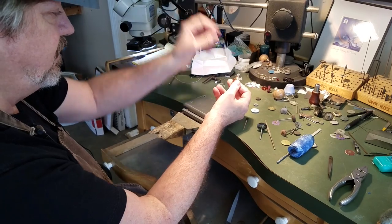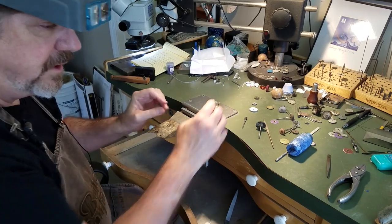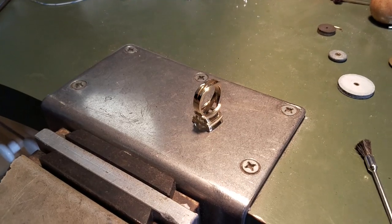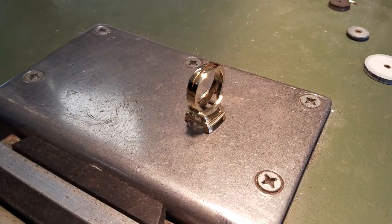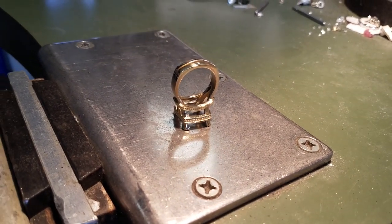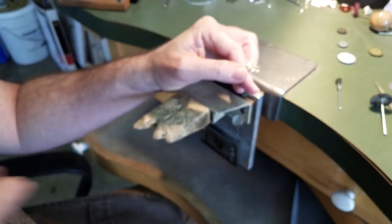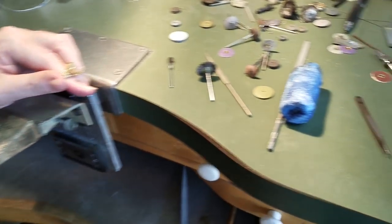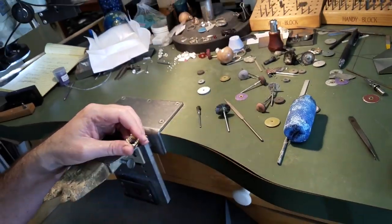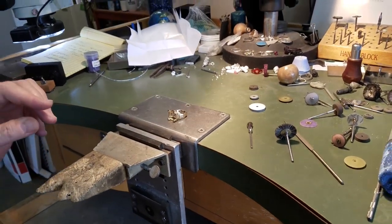Here's our mounting — it's all cleaned up now, all the compound is off. One of the things I want to stress is you cannot mix these compounds. If you mix the compounds, then by default you're going to the more aggressive compound. It's very important that you completely clean the ring between the Graystar and the blue or whatever your compound is. Also, you don't use the same wheels — you want to absolutely start with new wheels and not mix things.